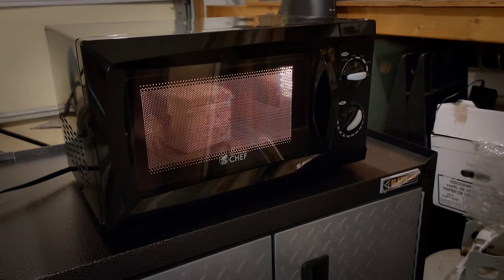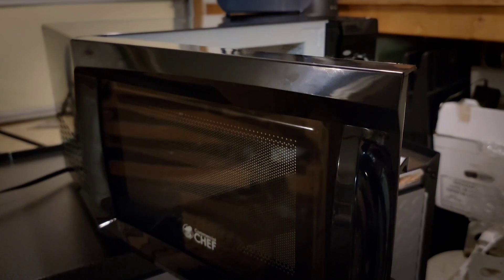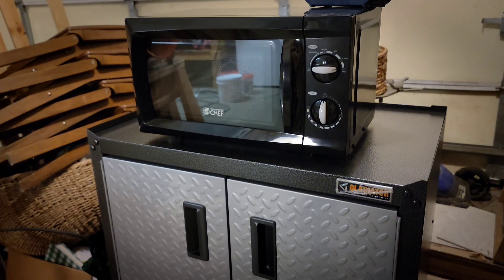I'm going to check this in about 20 seconds. We're reading about 138 to 140 degrees down at the peak, so I'm turning it back on. Just within one minute the temperature inside the kiln has climbed to about 400 degrees Fahrenheit, reading directly off the part. I'm going to zap this for another two to three minutes to see if the smoke doesn't get too much and if we get actual sintering. After a three minute cycle, I believe the smoke was from the initial spray binder I put on to support the part while transitioning it into the crucible.